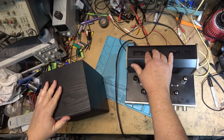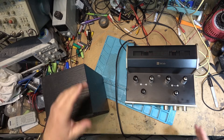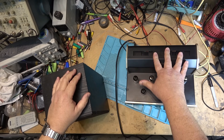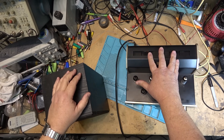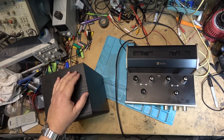So let's pop this thing apart and see where the noise is coming from. Vacuum tube amplifiers are high voltage devices, so you have to take all the appropriate care in servicing these units. Before you do any work on them you've got to remember that we're talking several hundred volts, so you've got to take into consideration that there is some risk involved when you get into the power supplies on units just like this.